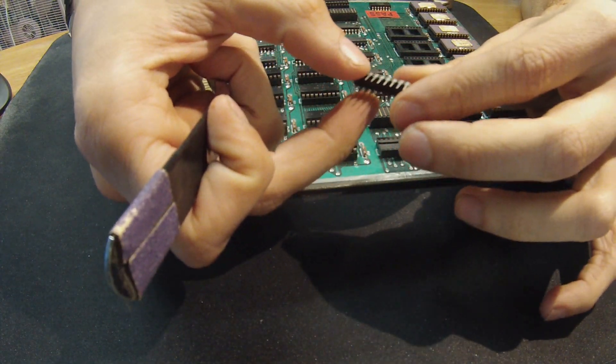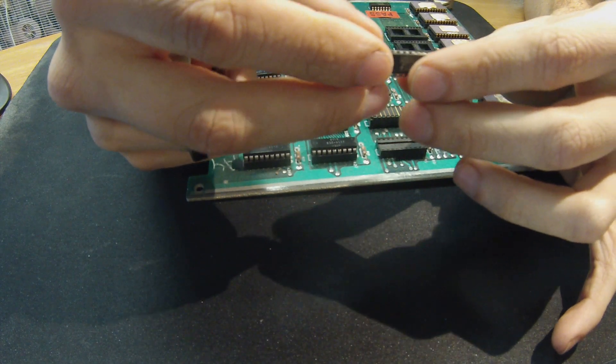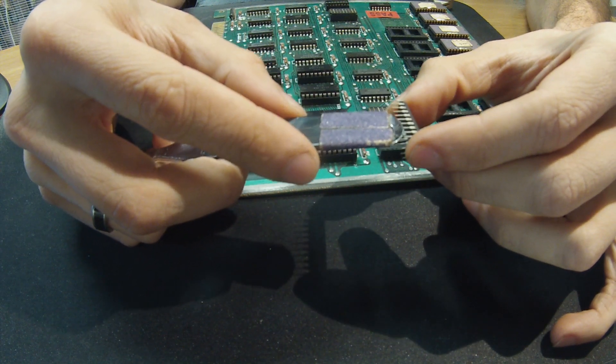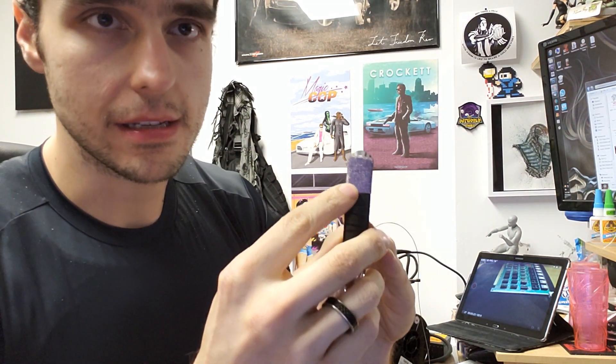They are very easy to break. Fortunately, the bottom of these legs are not very oxidized, so that's not too bad. What you can do — and what I have on the back of my staple remover — is a small piece of sandpaper. You can simply just run it down the legs very lightly. You don't want to do too much because you don't want to risk the legs bending. So this chip has to go back in now.